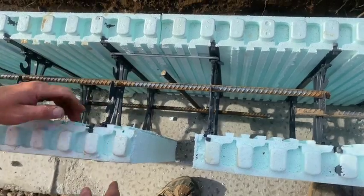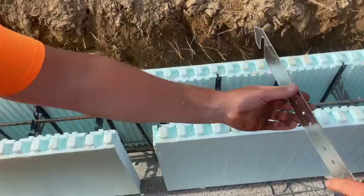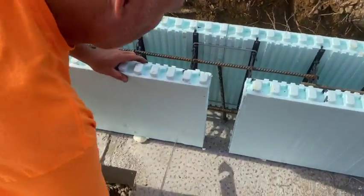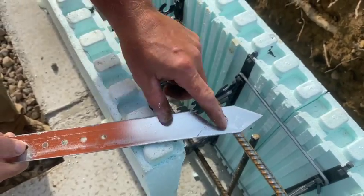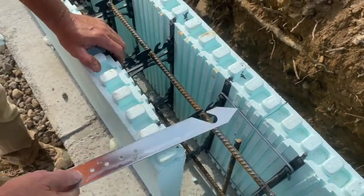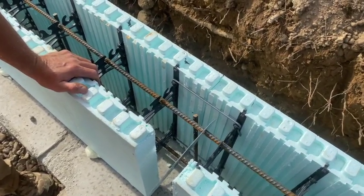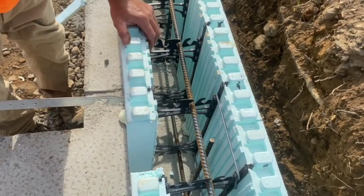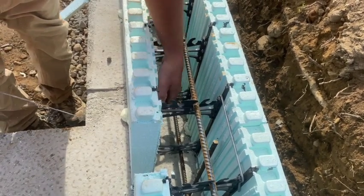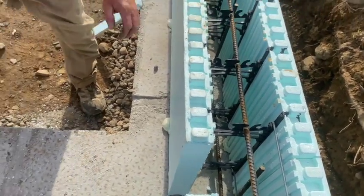So that's my bottom rebar. Let me see one of those T-straps. This T-strap is going to go through the bottom here — I'm going to hook it on there. That's the way it goes. Keep it nice and easy. So that's going to hook onto there like that. This has got a point on it and you can stuff it right through the wall. That's our bottom, and this top is going to get hooked. Now that we've cut that, we're going to put the block back in.